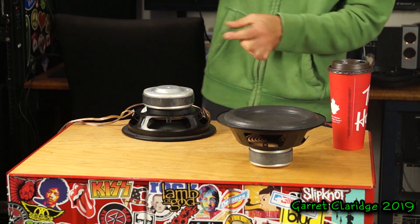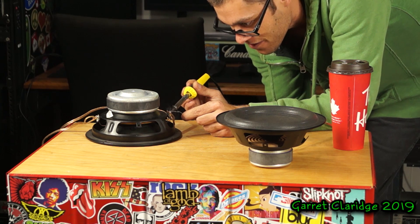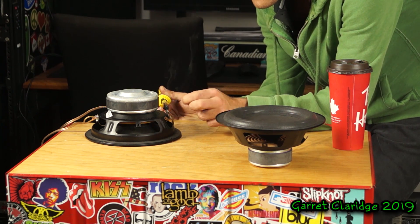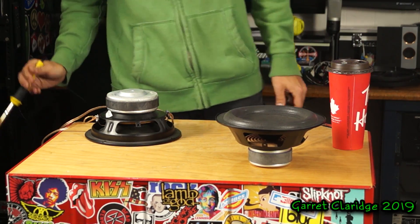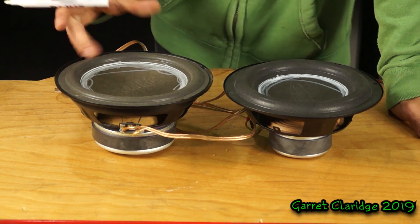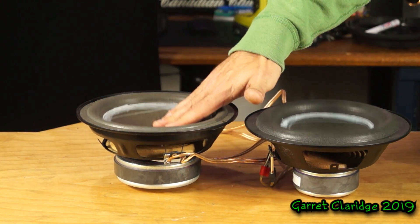Since the 100 watt has a dual voice coil, I'm actually just jumping the wires so they're gonna be getting the same signal. I'm pretty sure that's gonna have the proper impedance if you add them together. This is probably some of the worst soldering I've ever done, but whatever. To see the movement a little better I'm going to use one of these paint markers. We should be able to get a good sense of their movement now. There's 50 Hz — a lot of motor noise on these. I thought it was the bench but it's just the driver.